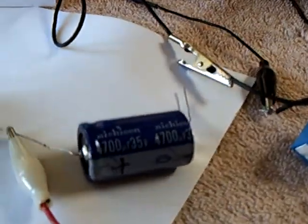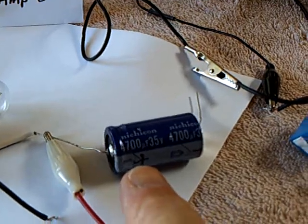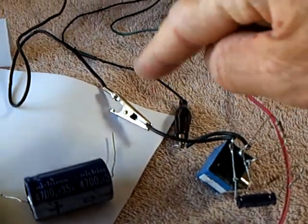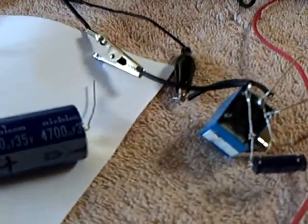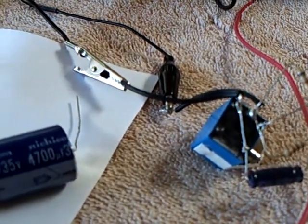This was the big news right here. I found out that if you put a fairly large capacitor between the bulb and the negative coming off the battery — this is the negative lead that comes into the relay — you increase the brightness and you cut down on the chatter that comes out of the relay.